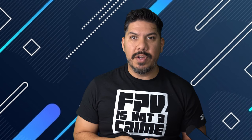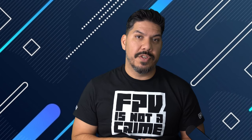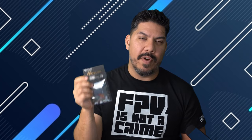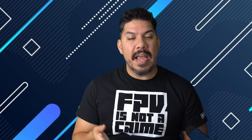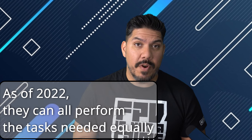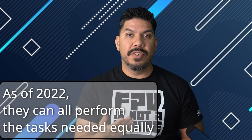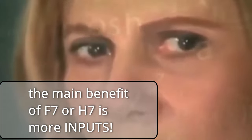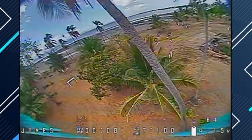Pretty much all of these will do what you need, but the newest versions of Betaflight 4.3 are starting to sunset the F411, so you want at least an F405 processor on board. The main difference is not what you would expect — it's not like shopping for a new PC where a faster processor makes your system run faster and better. For our purposes of calculating what needs to go on in the flight controller, you're not really gaining a lot of performance by having a faster processor.